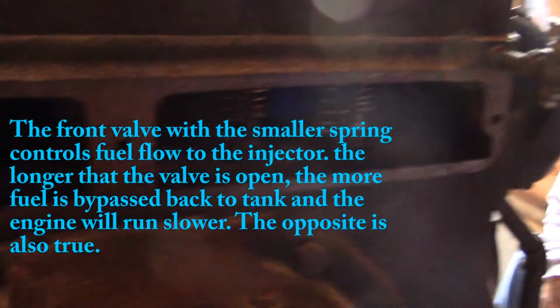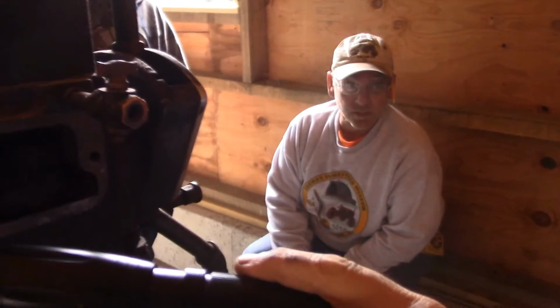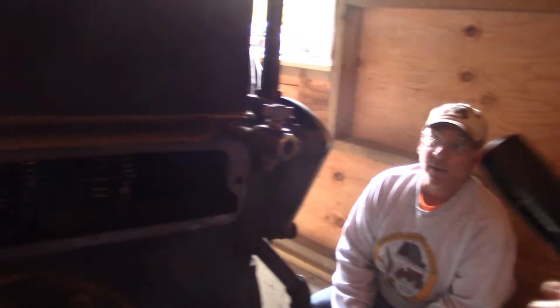And the other little wrinkle in this is right there at the back. That is your air timing cam piston. That little rod? Yeah, because obviously it's got to time when it injects air. It's only doing it in cylinder one. No, you're doing it in 2 cylinders on a 4-cylinder. I do see two pipes, two lines. That's why I... Oh, weird.